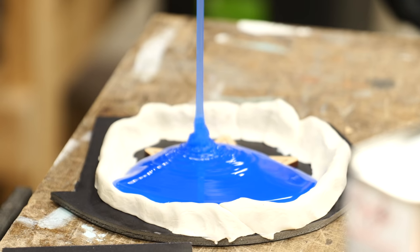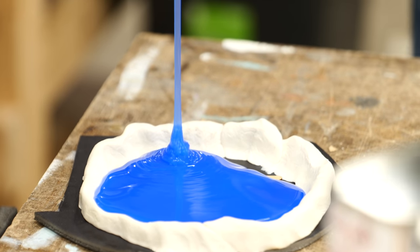There are a lot of silicones that don't require degassing of any kind. Oftentimes the lower the shore hardness, the thinner the material, and that makes it easier to pour without getting bubbles into your silicone. There are also some pouring techniques to reduce bubbles — if you pour silicone in a really thin stream and make sure not to move it around a lot, you won't be introducing new bubbles. Another option is to paint on a really thin coat of silicone onto the object you're molding to make sure there are no bubbles on the surface, then pour on top once it's cured.